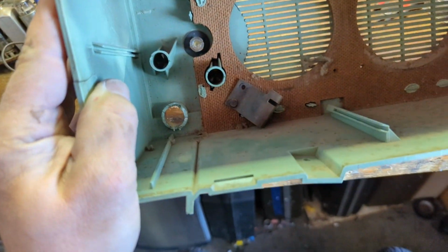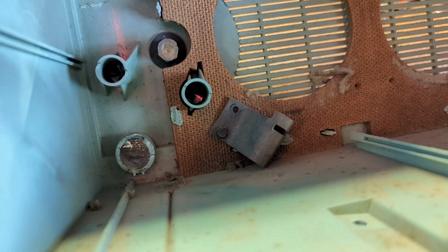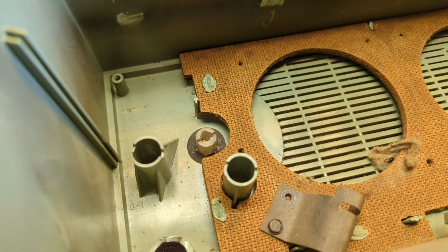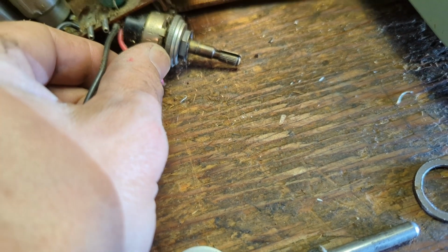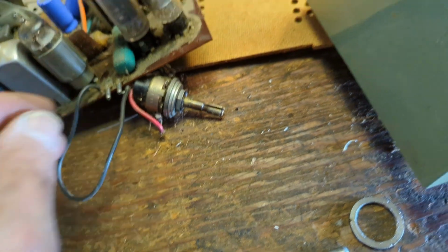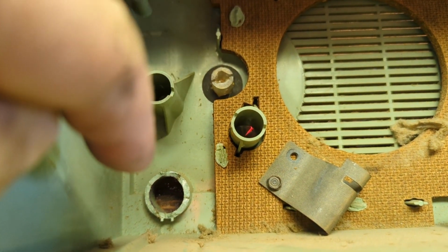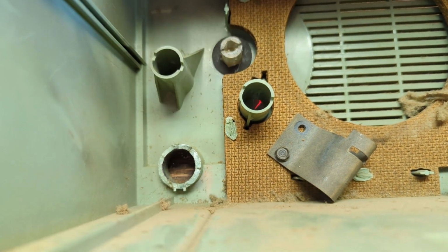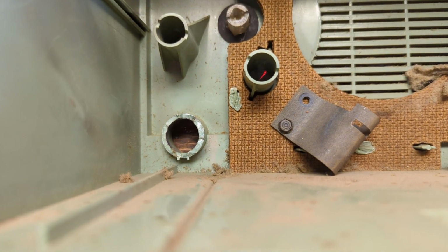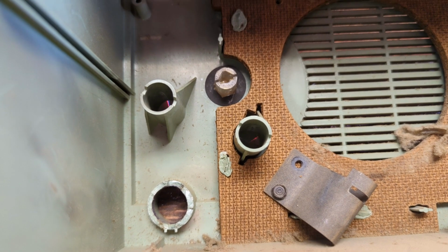Alright. So we're going to do some good old-fashioned redneck engineering. What I did is I cleaned off most of the broken off area. I measured the approximate height of the broken off pieces and stacked a bunch of washers here, so that will get to the approximate height of the disintegrated bits. What I'm going to do is roughen this up and put some JB Weld around that. Once I'm done with that, I'm going to embed this ring in it. And when it comes to reassembly, I think I'm going to epoxy or glue this thing back in there.